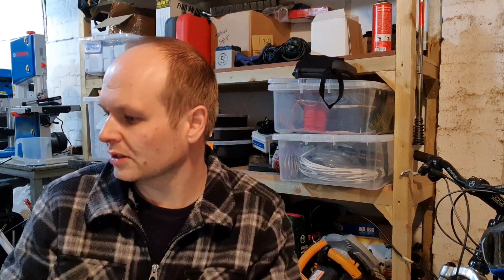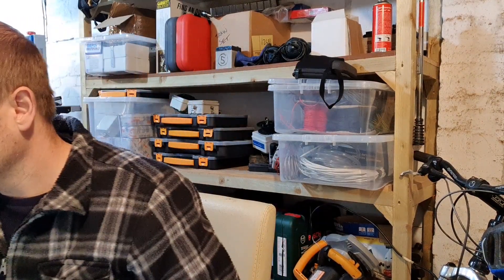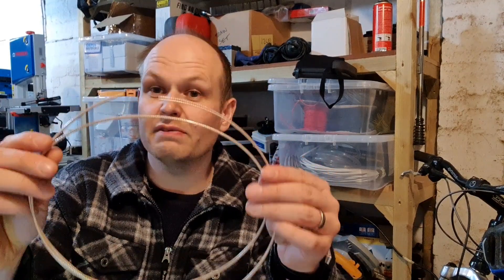So I thought I need to make this lighter. What I'm going to use is some of these little crimp socket connections — I have one on an SO239 and a 90-degree BNC connector. For coax I'm going to use RG316, which I've never worked with before. I'll put a link to all these parts in the description. My new tool, which you'll see later, is this crimp tool — I was hesitant to buy one but it was only £15.